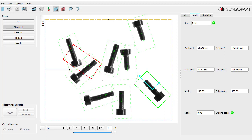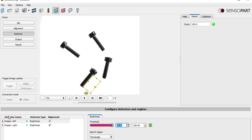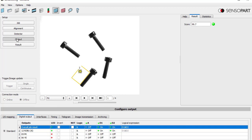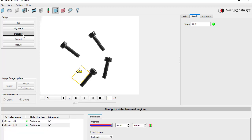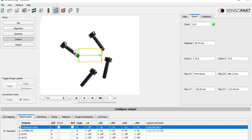On image 4, free space — we passed in the lower right. If you want others, you can go down and change the sort criteria from position y to x, and switch between ascending and descending to see how the chosen candidate moves. Now let's check these other detectors: we have our two gripper checks with thresholds set to 95, looking on either side of the threads. Our output overall job result is just d1 AND d2. If we add more detectors like a caliper for distance, we come to output and make sure we turn those off so the overall job result only uses our gripping space detectors.